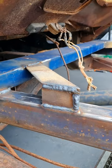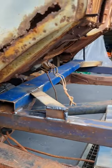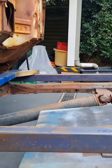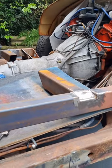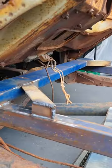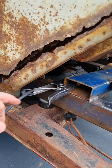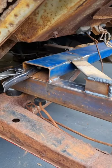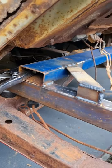But I'm pretty much ready to take this off, this subframe, flip it over, finish welding it. As I said, I may put gussets into those outriggers, but I'll finish welding everything up as best I can. Put some captured nuts in back here. Maybe I should do that, and tack something in there before I take it off.